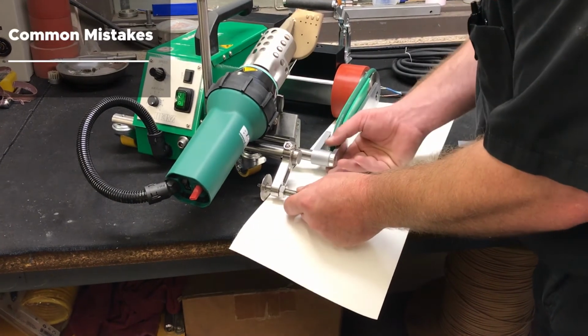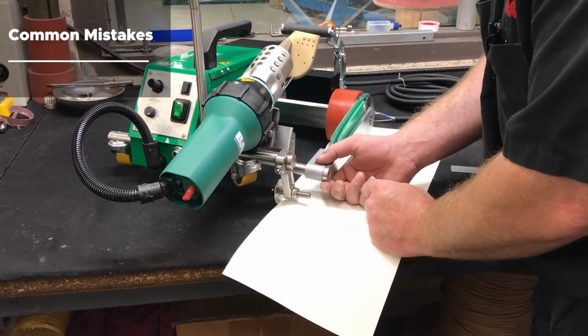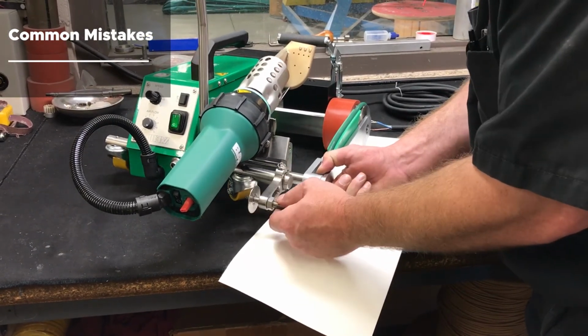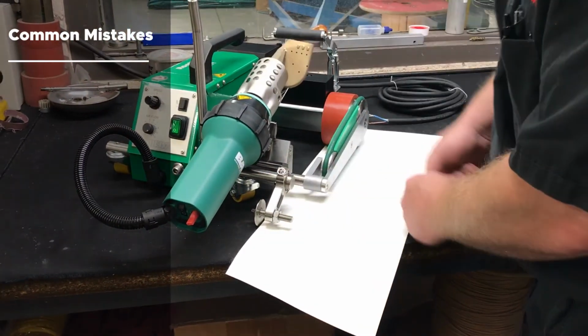Sometimes in storage, when putting the machine away, the rocker arm of the guide wheel will get lodged underneath of the axle. When you have the machine out on the roof to do the welding, make sure that the rocker arm is out and your 2 swivel casters are firmly touching the roof.